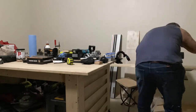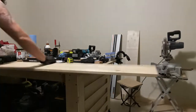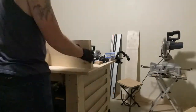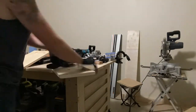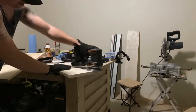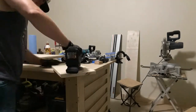So the actual shelves — you're going to have two 20-inch boards, one for each side, and then the board in the middle is roughly about 12 inches. Once you get those cut, you can go ahead and start sanding your boards down. Just did a light sand that way I could go back and hit it with the 120 grit and the 220 grit later on.